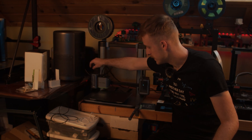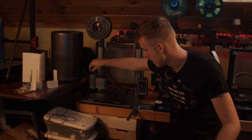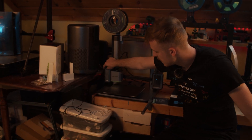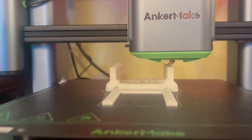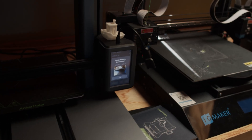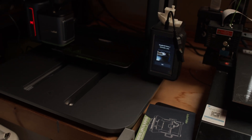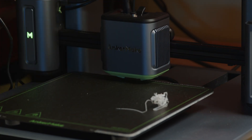The filament runout sensor is in this box, yet the extruder is over here, which means you have a situation where something could break inside — you press the filament in, it pushes the runout sensor, but the extruder still extrudes out the remaining filament and there's nothing going through the extruder even though it says there is. I actually updated my firmware and found that the AI detection feature can detect this, and it ended up detecting some of these issues, especially this runout. So I've downgraded this from a serious problem to just something to be aware of — make sure your firmware is up to date.